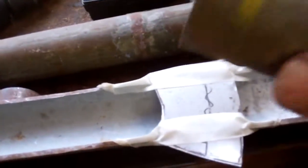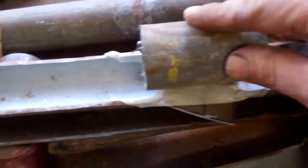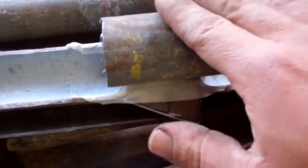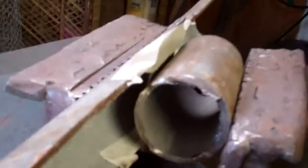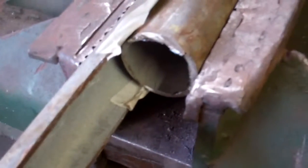This is something I've just rigged up myself to create those forms and finish it off by hand. It's basically just a couple of pieces of tubular steel - I've cut a pipe in half and that's my mould, and the other complete part is like the press. I'll just clamp that down in a vise and squash it down to give me a nice shape without all the ridges you'd get from beating it with a hammer. Just got it clamped in the vise, now I'll carefully press that in and the steel should slowly take its form.